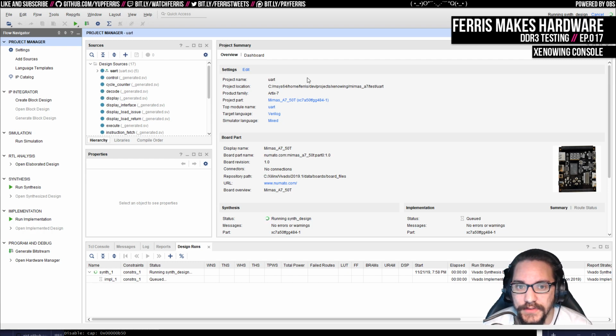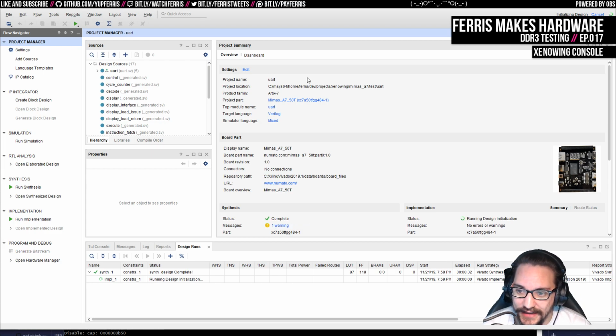And I'm thinking also to have it set up where it won't actually detect hazards, and it won't actually do wait states. So you need to program it in assembler and do a bunch of no ops if you need to use a register that's being written by the previous instruction, for example. I think that kind of thing would actually be really fun for a really small domain like this. And in that way, we actually have a programmable vertex stage, something close to a shader unit for the vertex stage before we actually have that for the pixel stage.